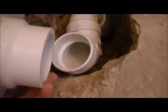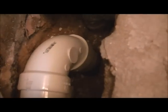When you put this inch-and-a-half end down onto the inch-and-a-half pipe and snug it down — of course it all gets glued in — all three parts get glued in. Then you have 45, 45 and you're almost at slab level. Then you get a shower drain cap that goes on here, and a piece cut from a two-inch section of pipe will go inside to marry these two together. Without all the glue in, I'm still a little bit above slab level — about an inch or so — but once everything is glued in it'll pop down further, so I'll probably end up with about three-quarters of an inch difference between the slab and the rim of the drain.